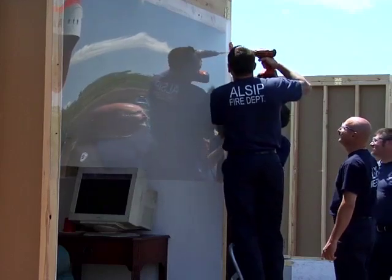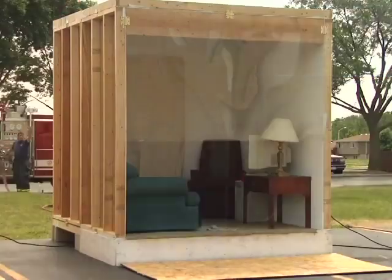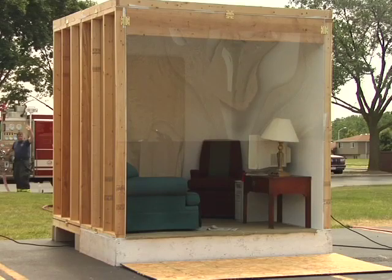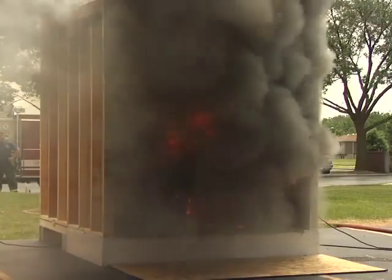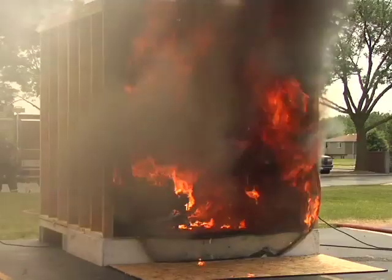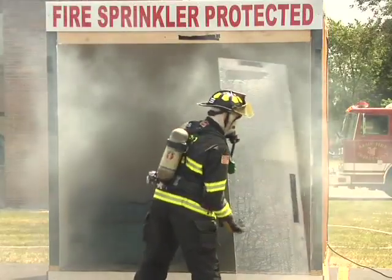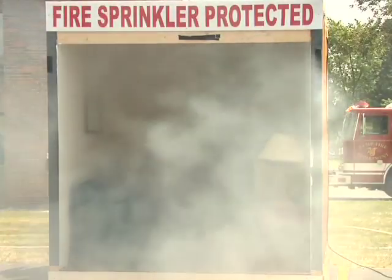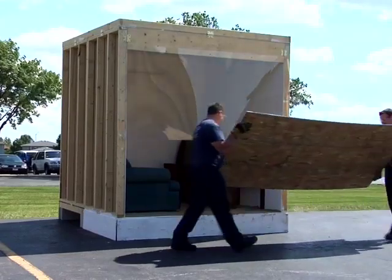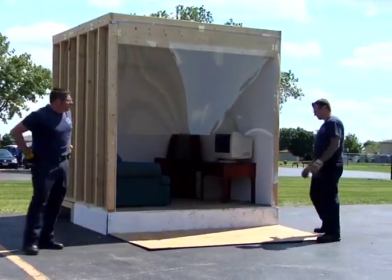On the morning of your demonstration, install the pre-drilled acrylic plastic across the top of the flashover room. Make sure it's secure, otherwise the heat will cause the plexiglass to pop off before it melts. The flashover fire will conclude in dramatic fashion when the acrylic plastic fails and the fire leaps out. The acrylic plastic for the sprinklered room should be attached with velcro so it can be quickly removed after the sprinkler puts out the fire. Place one four by eight foot sheet of plywood or OSB board in front of the non-protected flashover room to catch the melting plexiglass.